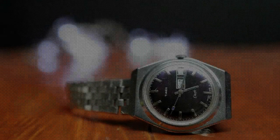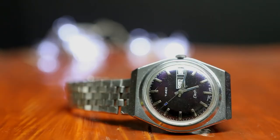So what is an electric watch? According to our friend Wikipedia, in horology, the term electric watch is used for the first generation electrically powered wristwatches. Specifically, in the case of the Timex Electric M40 series and similar movements, it is the most basic type of electric watch. The movement is very simple, and it's referred to as a moving coil, contact-controlled electric movement. We'll go into the details about this a bit later.